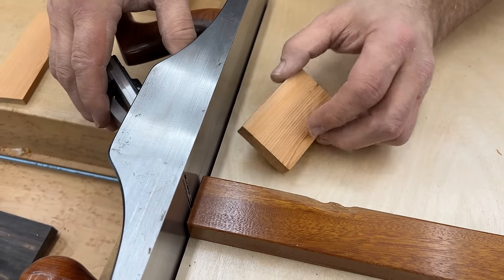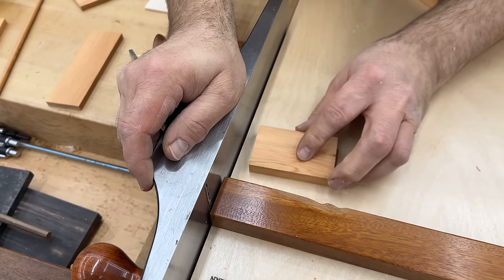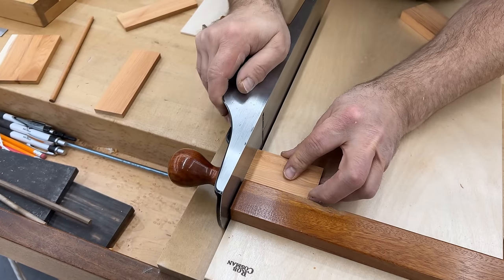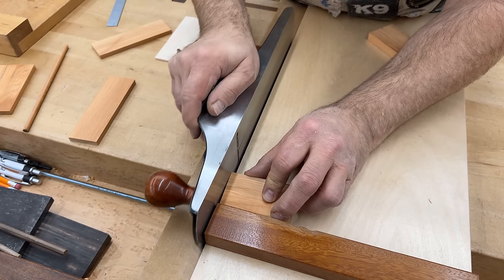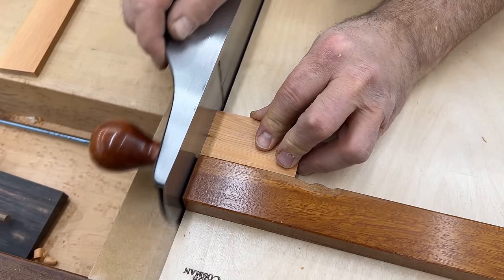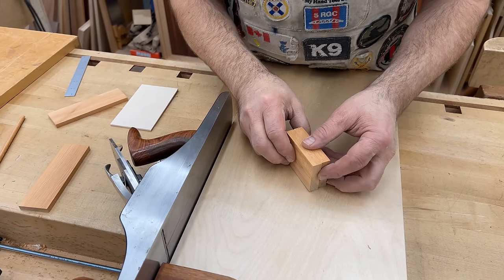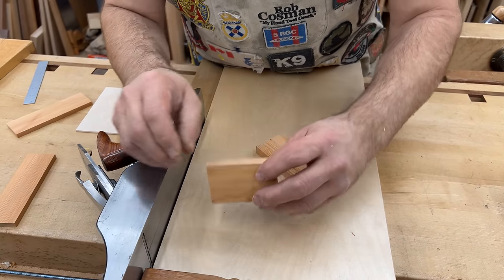Then once I've got some material to remove there because I've got a bit of tear. Now I'll cut a little chamfer, flip that over. That little chamfer protects the wood fiber from breaking off the end. And do the same thing on this side. I'm just pulling the board out a little bit from the end. Okay, so that'll be my standard. Make sure that it's already... Actually, that's too close to the length of this one. I won't have enough to clean it up, so I'm going to take a little bit more off of this.